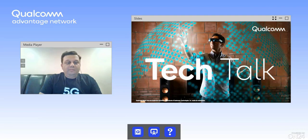Today we are showcasing an IoT connectivity solution, and specifically we're going to show you a demo using our Qualcomm Home Hub 100 platform. It utilizes our Qualcomm QCA4020 multi-mode SoC, offering Wi-Fi, Bluetooth Low Energy, and 802.15.4 based technologies, including Zigbee and Thread. In just a moment, Rajan Mistry, staff engineer with Qualcomm Technologies, will walk you through the demo and show you how to use voice commands using the QCA4020 to control a smart bulb, smart lock, and smoke detector via Bluetooth Low Energy. Rajan, take it away. Thank you, John.